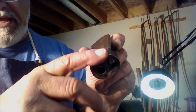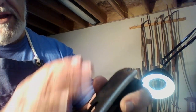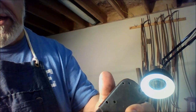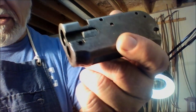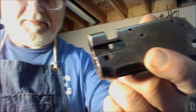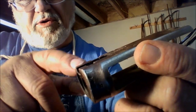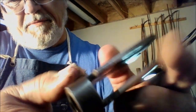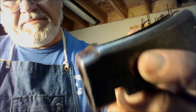this receiver that's been hammered across the front and bottom. We're not going to try and get the whole thing cleaned up. What we're going to do is try and just clean that edge up so it isn't mushroomed over. We're going to try and work on this piece where somebody had pounded on it and actually moved metal and kind of mushroomed it over. We're going to try and clean all of that up now.